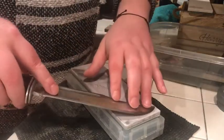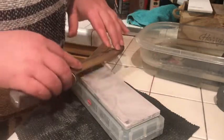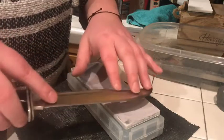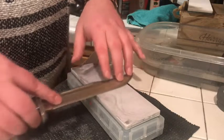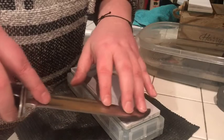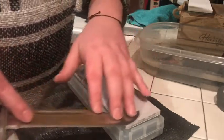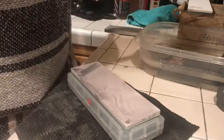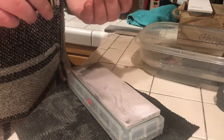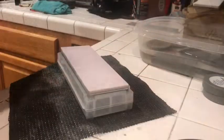Okay, we'll do some stropping strokes. See if we can. Sorry for that screeching. It's the problem with stainless: if you overproduce your burr, it's really hard to get rid of it, because you've essentially just weakened and damaged the steel in that area.